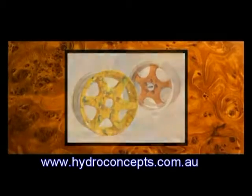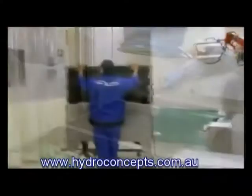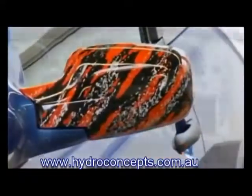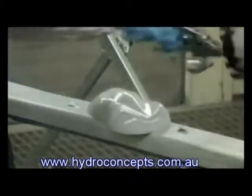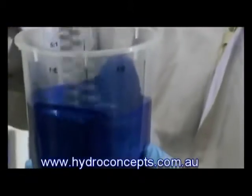Expand your work spectrum and use this amazing technology, suitable for all kinds of applications, allowing you to economically create unique designs. Refined by our water transfer printing system, your objects will be an eye-catching experience for everyone. Depending on the material, the object is first primed, dried, and then sanded. A high-grade base coat provides the foundation.